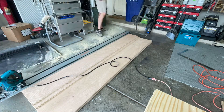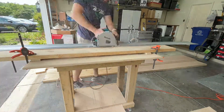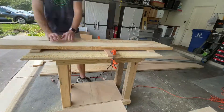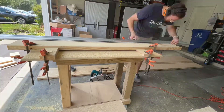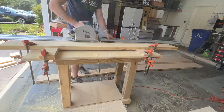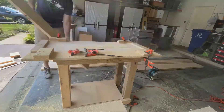This is a technique that's been done before — I've personally never done it. You essentially put the two boards you're planning to joint together, sort of closing them, and then run the blade down the middle so it's cutting into both boards. You can see all the clamps I'm using here — it's kind of tricky. You need to really finagle the clamps in a way that's applying pressure, but not too much pressure.